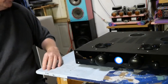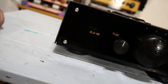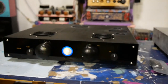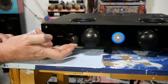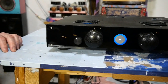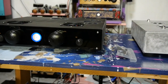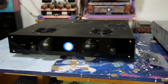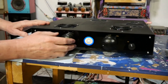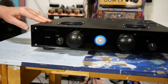This is now an ELD AB. The power output is approximately 130 watts per channel of Class AB. We've kept the tube, but we now have an adjustable dial for the tube and an adjustable dial for the solid state. So we have a tube input gain stage, a solid state input gain stage, a master volume, and also three single-ended RCA inputs.